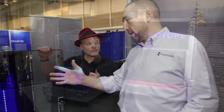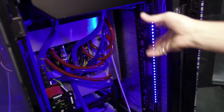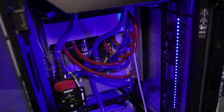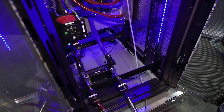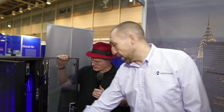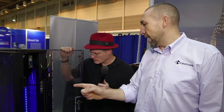What we've got here is our old prototype system — we've stripped out as much as we can so you can see what's going on. We've got our plenums for water distribution through the back of the blades. The hot water comes in from a tank at the top, down through the blades, and out through a plate heat exchanger, which decouples the system from the building water. You've got all the high-pressure grey water in your building, but I don't have to worry about that because it's decoupled by my heat exchanger. Then my pump just turns the water back to the top again and it circulates. And there's no fans in this thing — no noise at all.